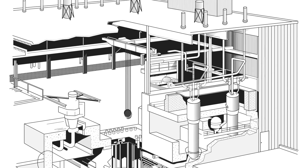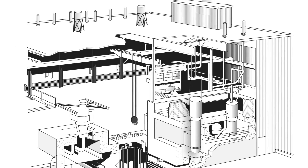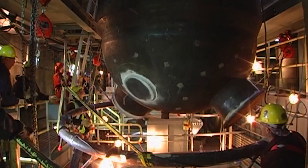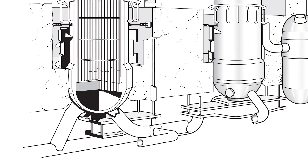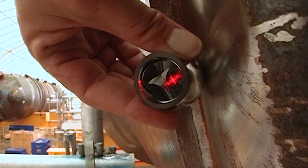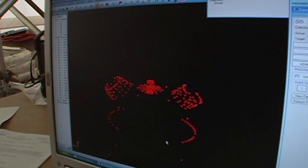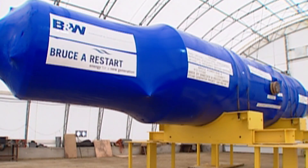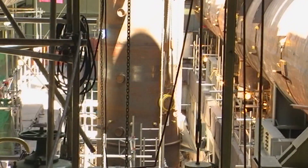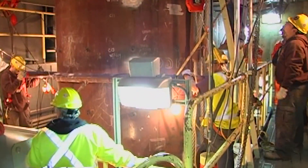The pathway to replace the steam generator is to lift it out through the entire roof of the powerhouse. It involves removing a lot of interfering pipework, electrical and instrumentation components, and ductwork to allow free access for lifting out and lifting in. The trick is knowing where the ends of the pipes are that you have to reconnect the steam generators to. We use a very precise laser metrology technique which provides accuracy of location of the pipe ends in three dimensions to about a couple of thousandths of an inch. The new steam generator nozzles can then be machined separately, and when we lift the steam generators in they will connect directly to the pipes.